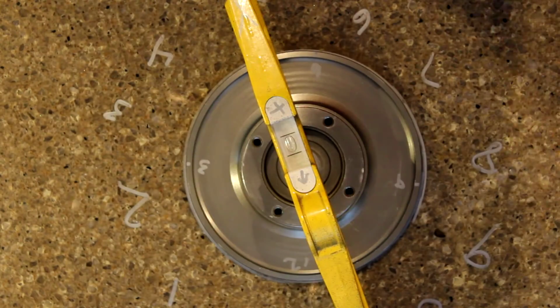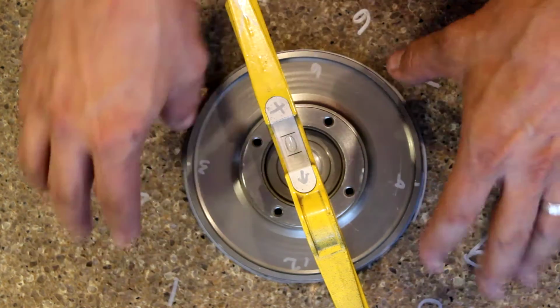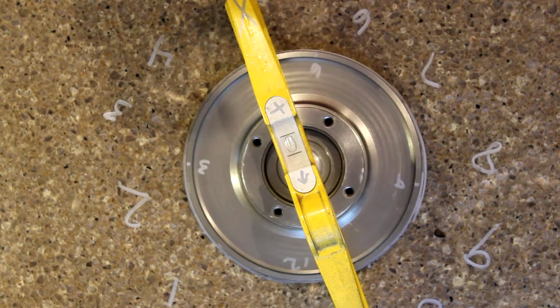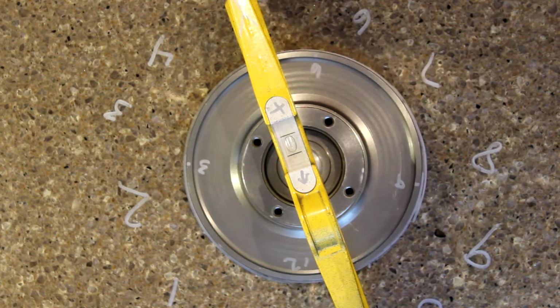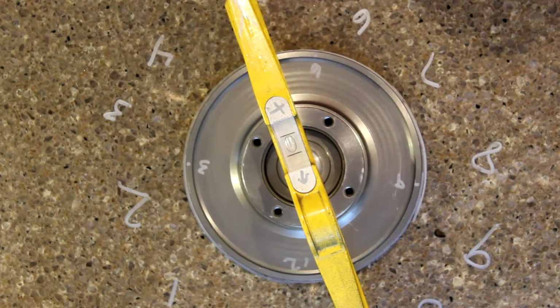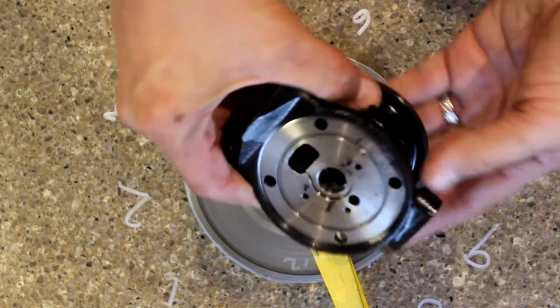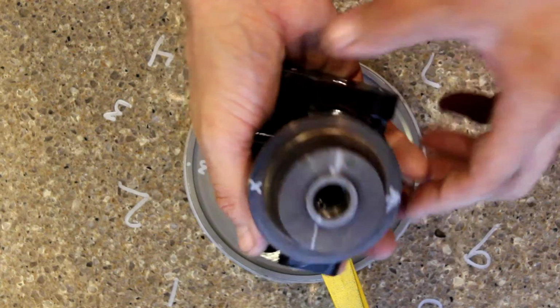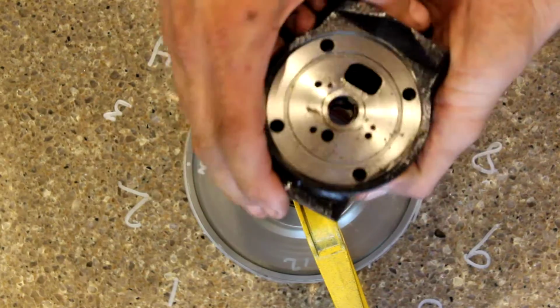So what I'm doing today is making a document, I guess a study, based upon a flat granite countertop surface with some clock references to show where I feel the reason why we had an issue with the wheel making contact with the compressor housing. This is what's called the CHRA. This is the center point of the turbo. I've made some reference marks, which you'll see here in a little bit, and why I made them.